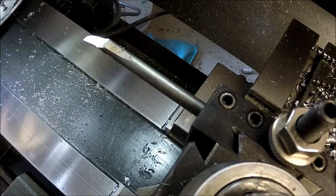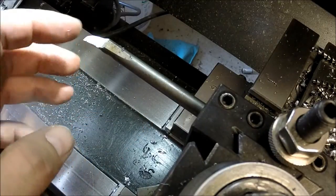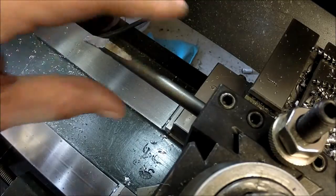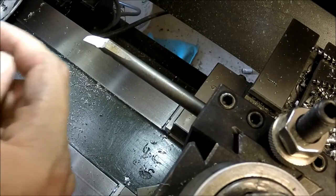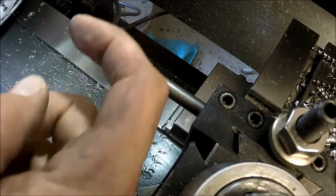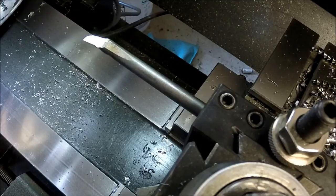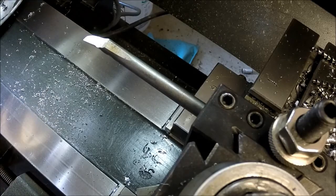Feels like it's cutting okay. I'm hitting the edge of the drill, and so there's a little bit of an angle, but it's hitting and it's cutting on the front a lot. I can feel the chatter picking up. So what I'm gonna do, since I have the DRO, is come in and just make small cuts across. Just kinda come in and kiss it and then cut, and kiss it and cut, until I get my depth to where I need it. The other thing I'm gonna do is get my air compressor hooked up over here so I can get all the chips out of here.